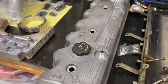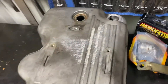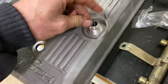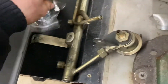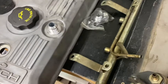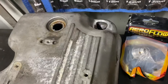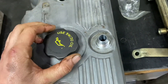How's it going YouTube. Just a little job today - got to weld these fittings onto this rocker cover. It's off an AU Falcon; he's doing a turbo conversion, it's going in an XF. We've got to weld these fittings on, and he wants these fittings welded on the rail and just wants the reg and that deleted, more or less capped up. Pretty easy one, though unfortunately it's not that clean underneath - being cast alloy, it's never a good thing to weld, but we'll give it a go. Let's put you on time lapse.